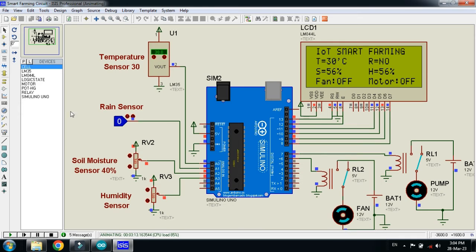Now let me check the soil moisture. Here you can see the soil moisture value is 56%. Let me increase it — you can see 81%. Now let me decrease it below 40%. Here you can see it's at 41% and the pump is off. Now decreasing below 40 — here you can see the pump started and on the LCD the pump is now on. This is how the soil moisture sensor controls the pump.